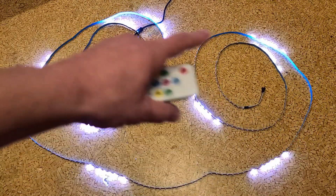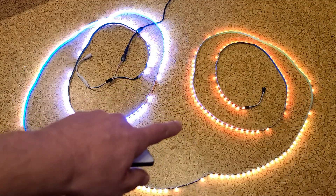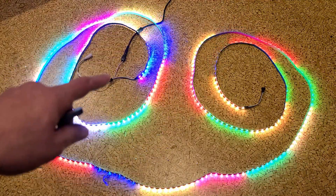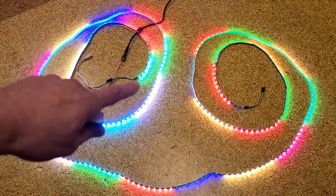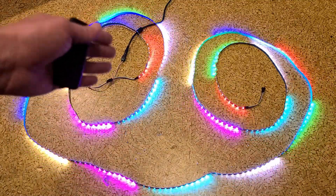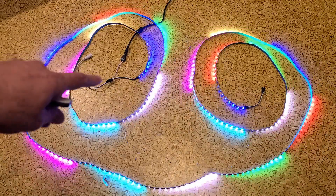A lot of these advanced LED strips — you just saw how it was trying to do white and you'll see that here. This is a problem with 5-volt LED light strips if you get the really long ones: there's a voltage drop from the big long piece of wire that the LEDs just can't light up, even with the little connectors where you connect the 5-volt power supply directly to the LED strip.